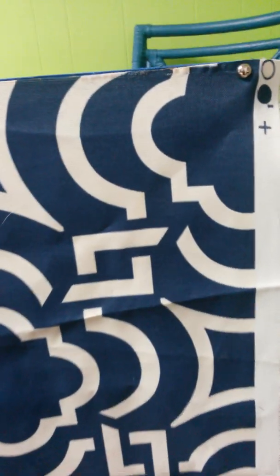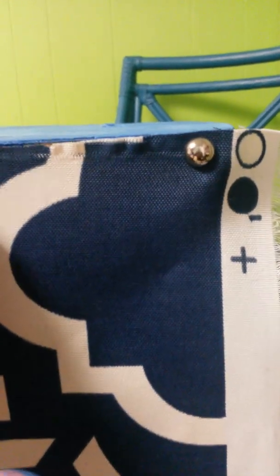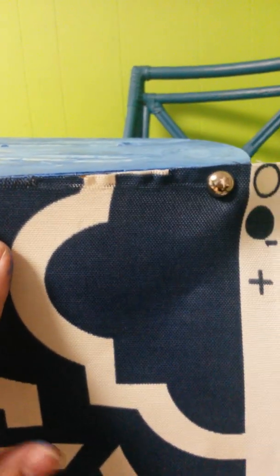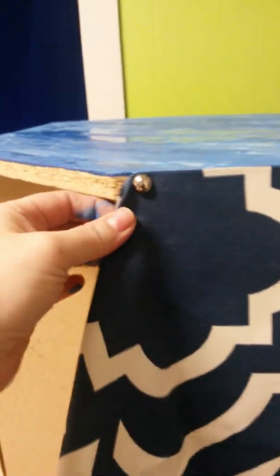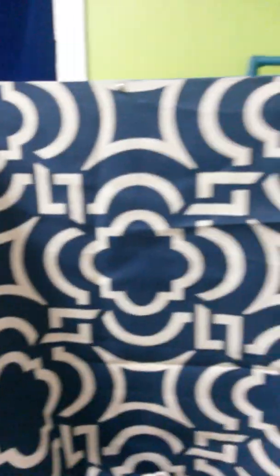Your normal rubber mallet works better than an actual hammer because you'd ruin the finish on the outside of the upholstery tacks and might hammer too hard. You want to be really careful that the first furniture tack is as even as possible. Make sure you get everything as even as you can. Then go to the next central part of the desk and get the next one in so you've got the whole side panel started. When you start even, it's easy to keep the whole thing even.